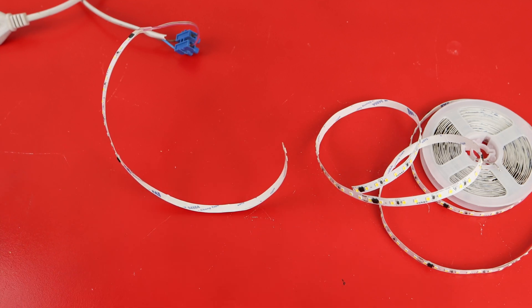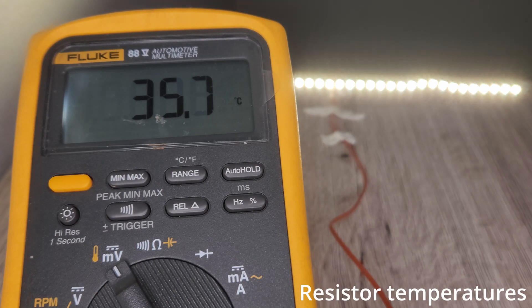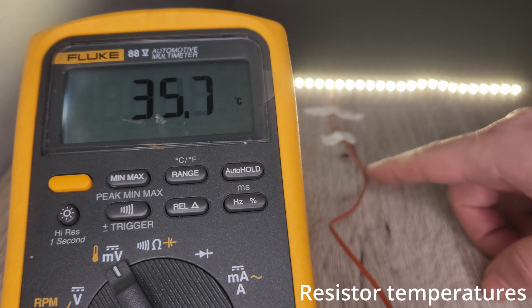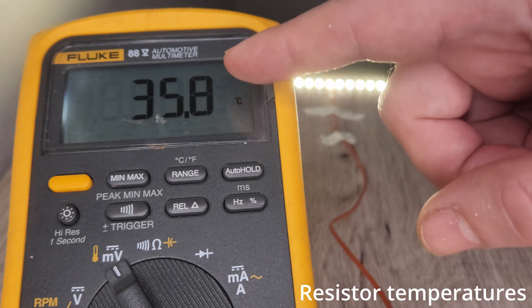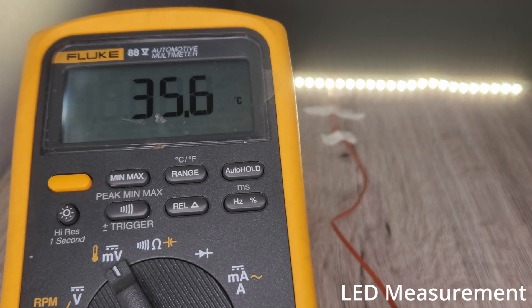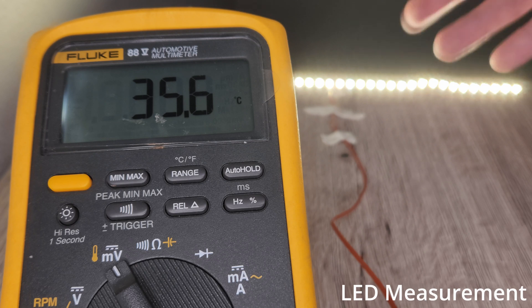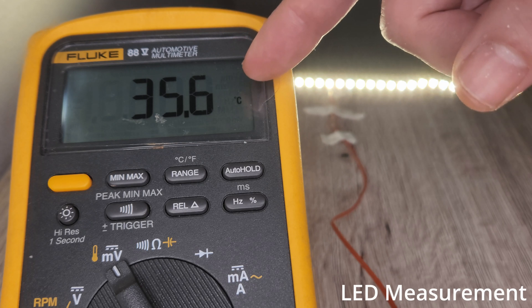I will cut some pieces with scissors and leave them open to check how much heat is produced. After an hour it looks pretty bright because the light is pointing directly at the camera, but in real life it's not that bad. After about one hour, the thermocouple on the resistor stabilized at around 36 degrees Celsius, which is good. Even in open air it will reduce further, so it's quite suitable for this application. Checking the temperature on the LEDs shows it is more or less at saturation — even airflow from talking near them causes the temperature to drop slightly.